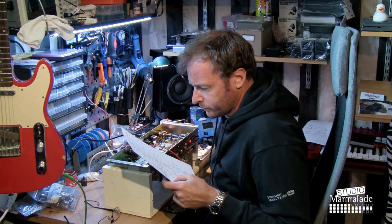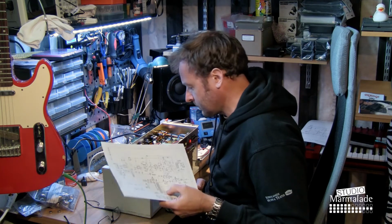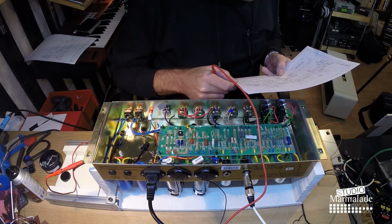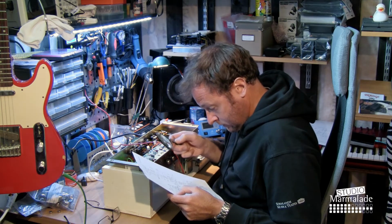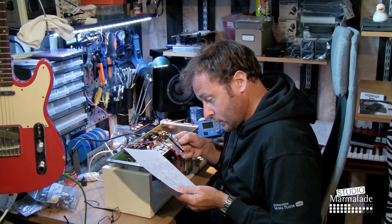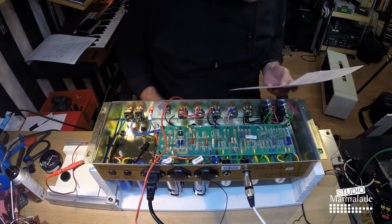there are only the capacitors, and they're attached to the same point underneath. Now they should be pretty much the same. I need to look into this. I may as well check the other cathode resistors. On the second valve, we have an 820 and 100K. And on the last one, and they're parallel because that's the phase inverter, that's the R17, should be 470, which also makes sense. There is definitely something weird with the first valve.